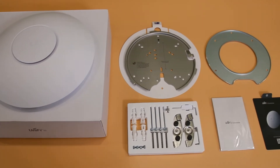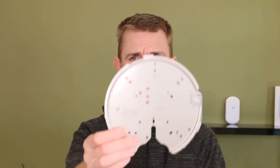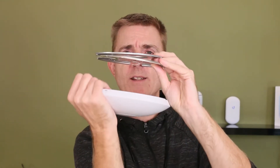This is the device itself, which we'll come back to. Just want to talk you through everything else that you're going to get. You're going to get a template that'll allow you to drill and get all the holes in the right place, whether you're doing that on the ceiling or on the wall. It comes with the versatile ceiling mount — you get the main multi-drill metal plate. Fit that as you want. You're going to get your above-ceiling tile if you're putting this on a false ceiling. You normally put this on top, bolt these two together until they're tight, then bring up your access point and clip it into place. Obviously not needed if you're just mounting straight to the ceiling — you'd just be using this plate.